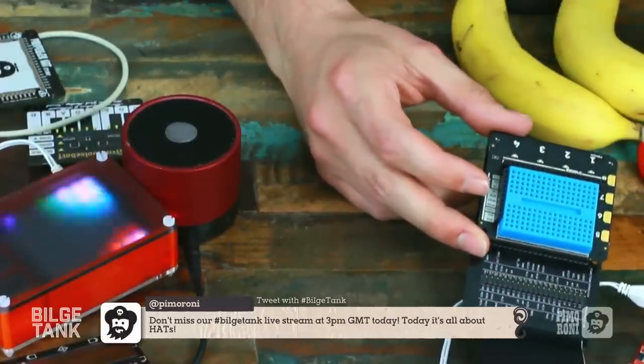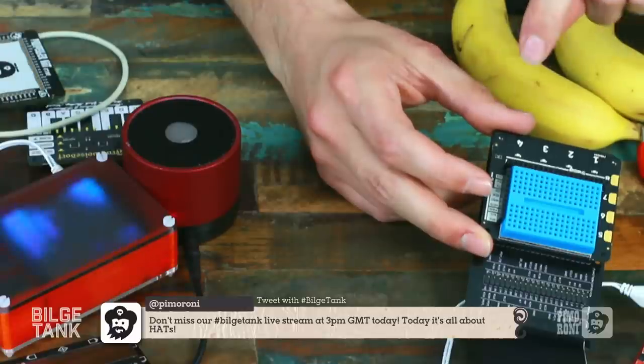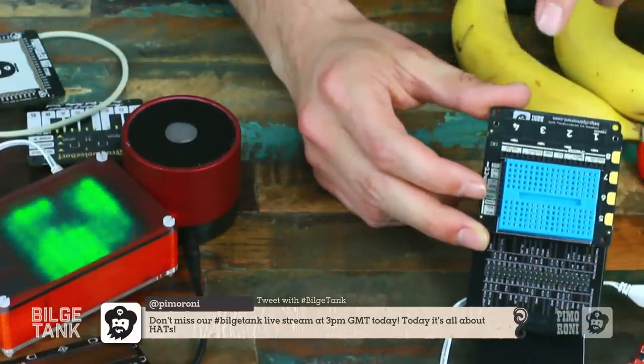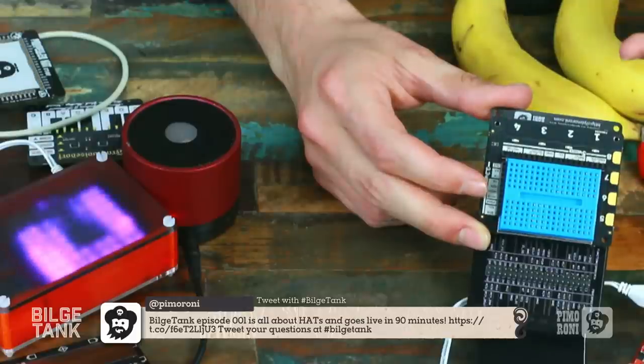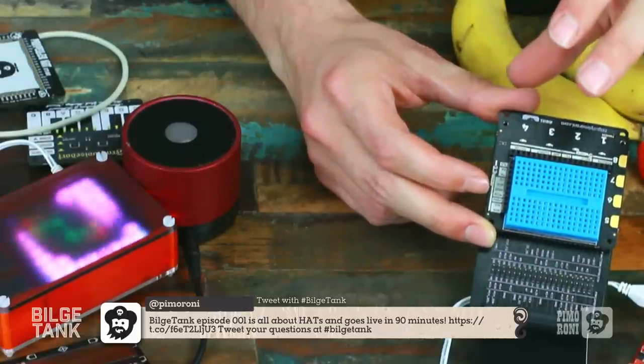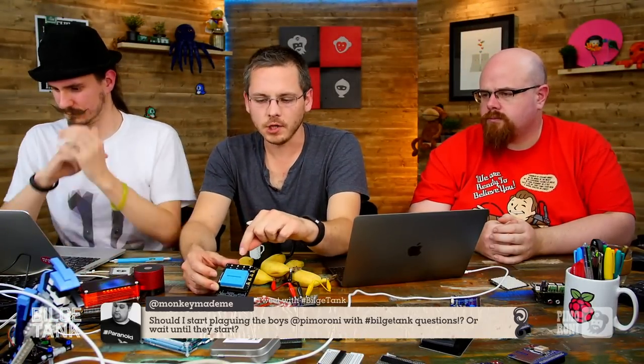And then the very last feature was two H-bridge motor drivers, and these are basically critical if you want to make any sort of robot or buggy. An H-bridge lets you drive a motor in two directions, so it actually reverses the voltage between the two pins. There is basically no other way you can do that without some discrete circuitry, so we thought building it in would be a really nice feature. From this you can build buggies, robots, all sorts of projects, cat feeders, M&M sorters, literally.